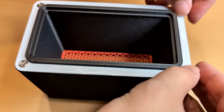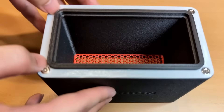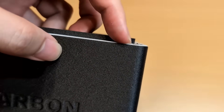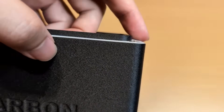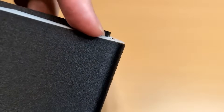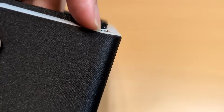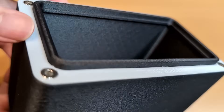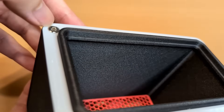Initially I planned to skip the soft sealing layer and rely on tight-tolerance cut-through shells. However, I ended up loosening the tolerance for better usability and added TPU to close the gaps. That meant the magnets had to protrude slightly more to account for the thickness of the TPU.